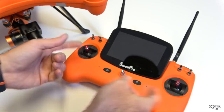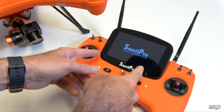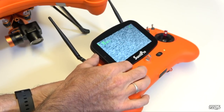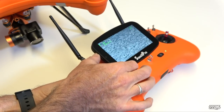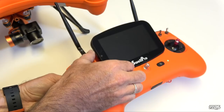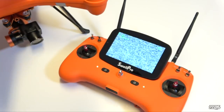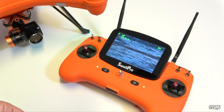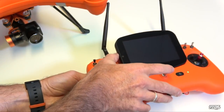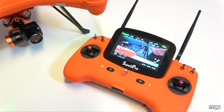A lot of FPV racers use 5.8 because it has a higher frame rate — WiFi video tends to lag, which is bad when flying a large aircraft. If the video starts to lag and get choppy on the bench, that means the video transmitter is overheating. Power off the drone to avoid frying your video transmitter. Some final thoughts: I think the SwellPro Splash Drone 3 is a pretty awesome drone. They've done their R&D — it doesn't feel cheap. The transmitter is ergonomic, it has all the on-screen telemetry I want, and running 5.8 instead of WiFi is two thumbs up from me.